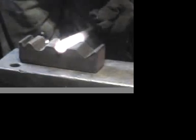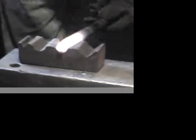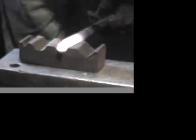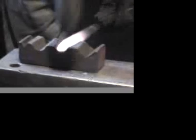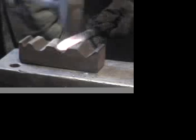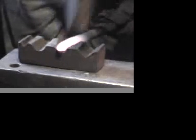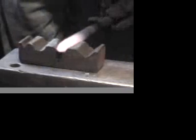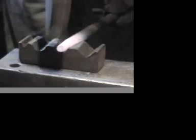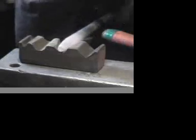Now we're going to use a slightly heavier hammer and work backwards slightly from our conical point. There's always a balance in this project. If you strike too hard, you merely collapse the tubing. So actually, a long series of light strokes achieves the shape generation faster than really pounding. Now you can see that the cone I've generated is now fitting very sloppy inside of the die.